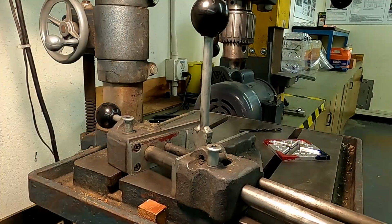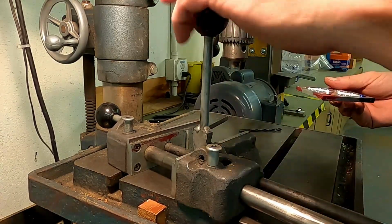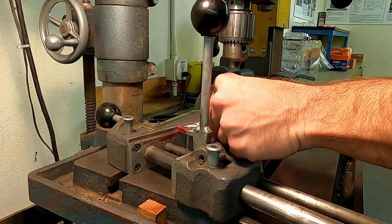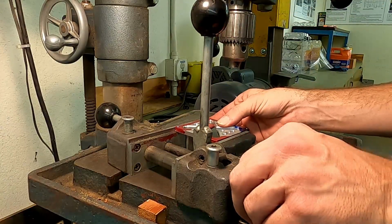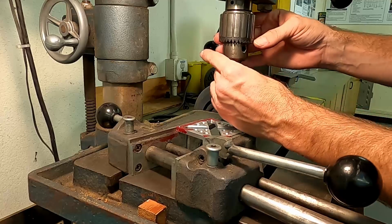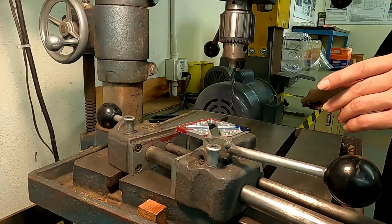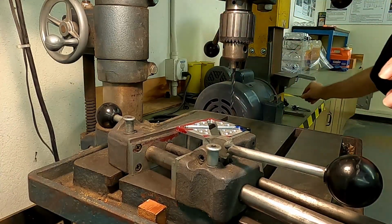We've got our part. Okay, we're over at the drill press and we're going to set our part into a drill press vise. This is sort of a cam lock device here. Set our corner out that we're interested in. Set it out just far enough to make sure we'll clear the vise. And then I've kind of adjusted this guy, a little bit of wiggle now so that when I pull this cam down, we snug it down but we don't crush our part. Then we'll go ahead and put our drill bit in. And tighten. I'm going to tighten this guy good and snug.